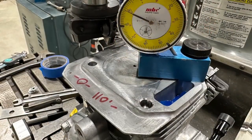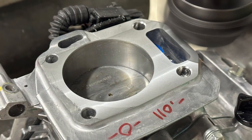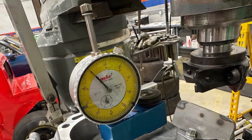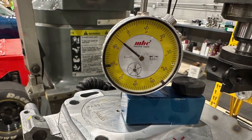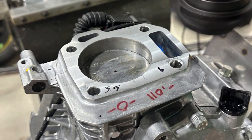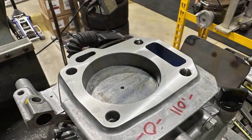As you can see, we've taken many passes, a couple thousandths at a time. We only have ten thousandths to work with. You can see light spots and dark spots because it takes about seven thousandths to get the head completely flat. We ran gas through this motor and there's a little bit of warpage already on the head, so this process is cleaning that up. After about seven thousandths, now the deck is completely flat. We'll go maybe one or two thousandths more and finish it up.